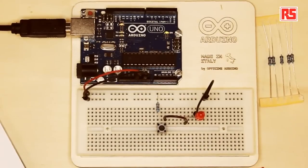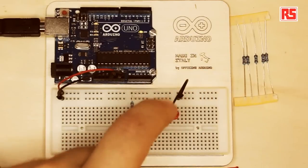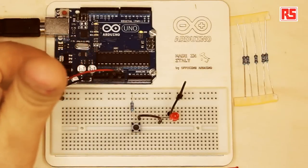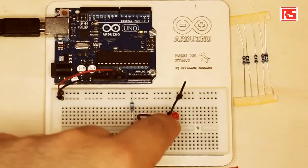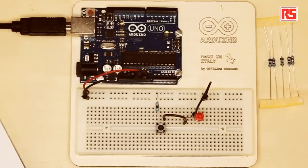We have our completed circuit, and I'd like to make some modifications to introduce other concepts. This is a very simple circuit where each component is connected to the next in the circuit, and the last connection goes back to GND. You can imagine the current flows from the red wire into the circuit, through the resistor, through the push button, then through the LED, and another wire back to GND. This is how the circuit is closed. The elements are connected in series, because one component comes after the other.